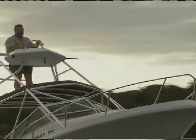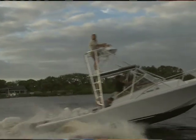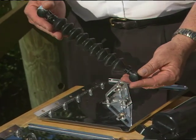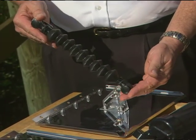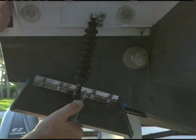We're also going to be dealing with the porpoising problems that we're having with the vessel, as well as the bow rise problem. When we're running the boat, we don't have real good visibility. We want to bring that bow down, and we're going to be putting on something called trim tabs. The particular trim tabs we're putting on are something brand new — these aren't hydraulic and they're not electric. These are spring-actuated and they're self-adjusting. Pretty cool stuff. We're going to test them out firsthand for you.